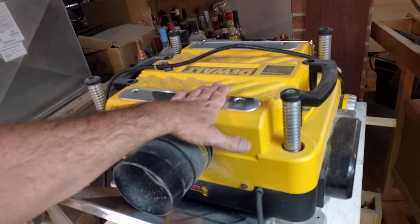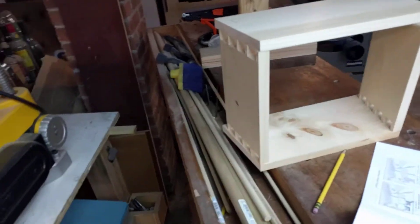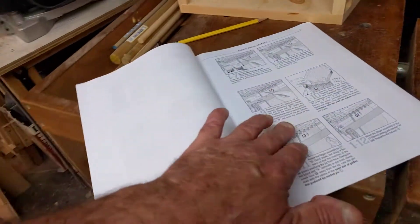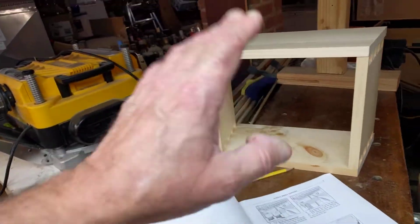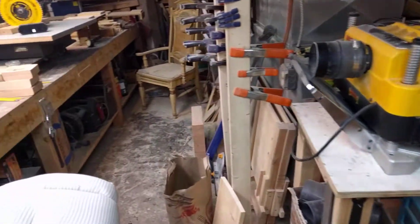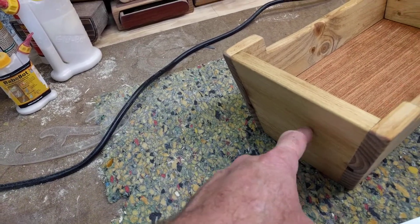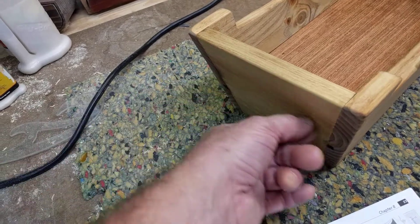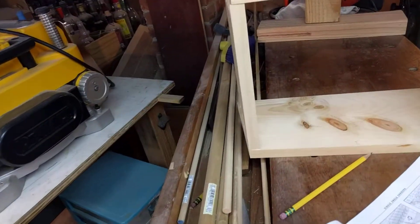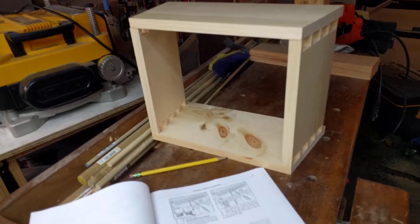Just learning how to use this planer here — we used it to plane this board. This was cut out of a one-by-twelve piece of pine, and they want you to rip one-by-sixes. I went ahead and fed this whole thing before I cut it up — lesson learned: do that at the beginning, then cut your pieces out. I fed one piece through no problem, fed this piece through and got horrible snipe. That's when you get a little valley — the rollers inside the machine eat into the piece. My UK friend told me to use double-sided tape to tape it down, which was a great suggestion.